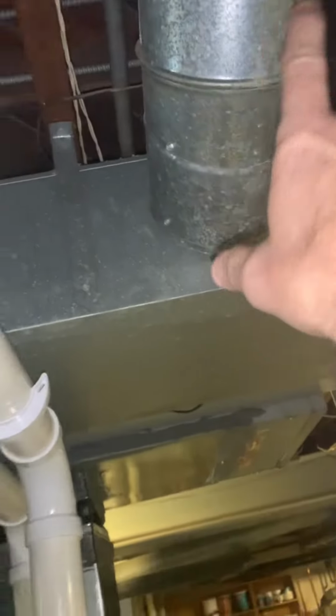So we'll need an 8x12 inch patch for the side, for the top, and then one over here. So this is going to the kitchen. We'll turn this elbow, run across, and come in right over here. So everything's over on this side. And then what comes down here will be 8x16. You'll utilize that hole for your damper, put a patch there, 8x12, and then we'll run across.